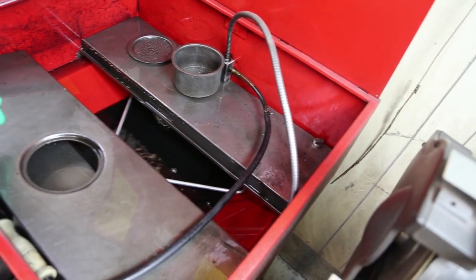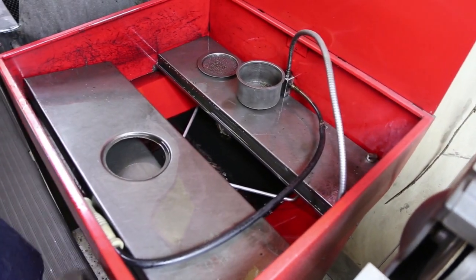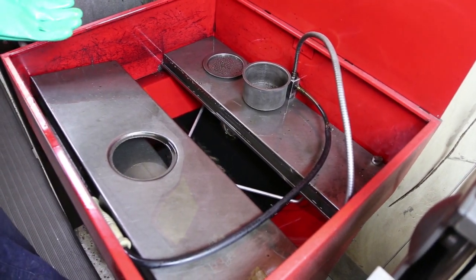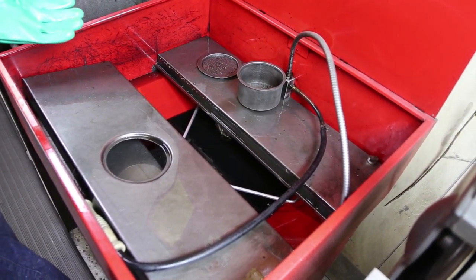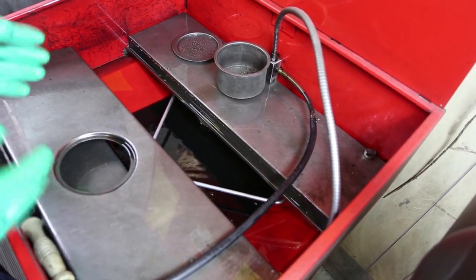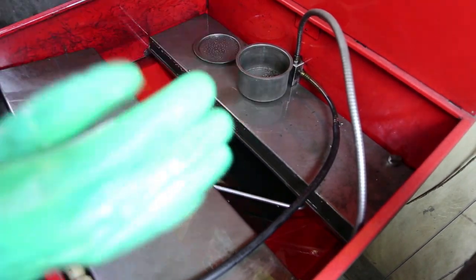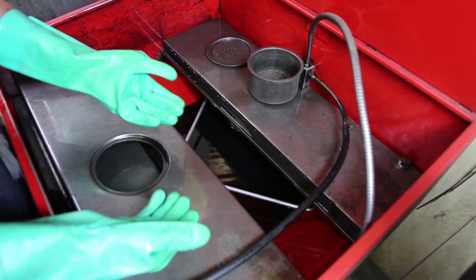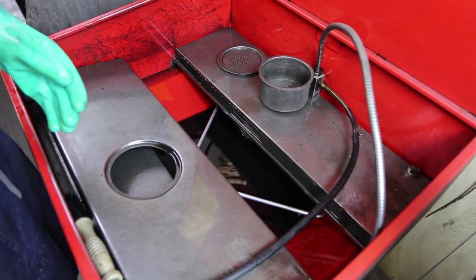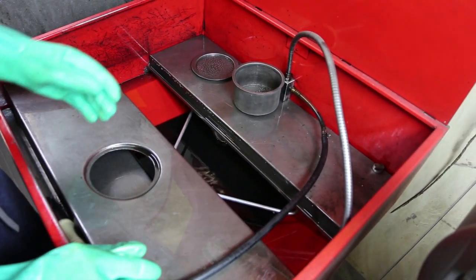All I have to do is hit a recycle button on the machine. The whole process probably takes 2 to 3 hours to recycle it. It actually boils the solvent, condenses the solvent. All the oil and dirt settle to the bottom, go to a holding tank. One thing that'll be coming out of here next will be clean recycled solvent.